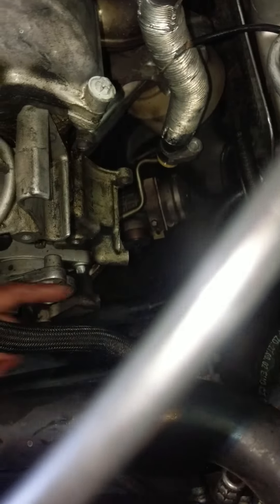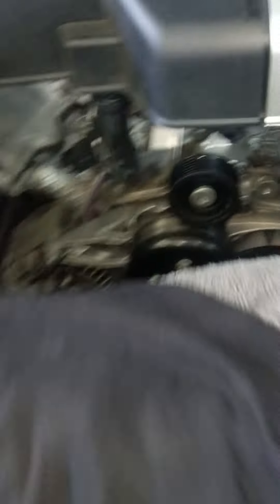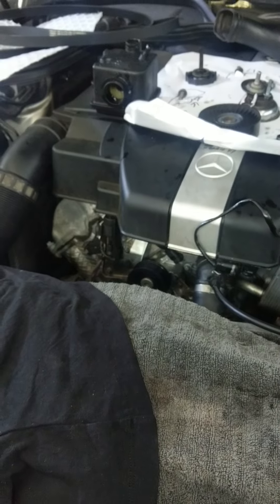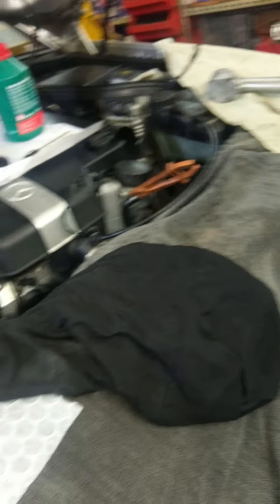I think I'm pointing to the wrong thing — that's the power steering. No, that's the upper compressor housing carrier. You can see the power steering goes here. It's really nice engineering, but it doesn't work. For that whining noise, you do get the pump failure, the compressor failure, but you also get on these sixes the alternator failure, where the water pump goes from here to here, and the way the belts are — it's an opera house of sound. You'll get that really loud whirring whining noise, it projects the sound outwards, and can be very annoying and very loud.